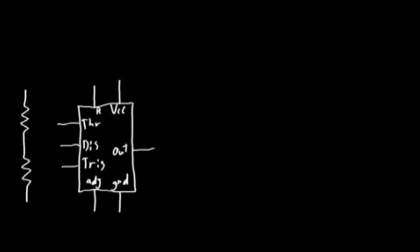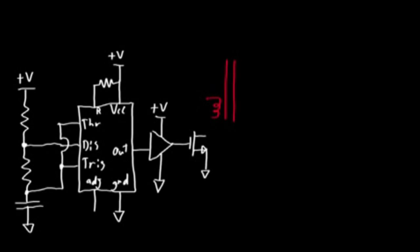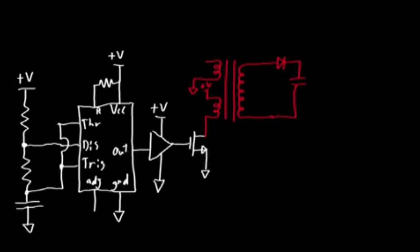What I want is something that latches off until the inductor is discharged, but also will continue to oscillate if the output is shorted. I'll call it the Joule Thief 2.0. I'll start out with a TLC 555 timer, because I can't think of a more obvious way to make something oscillate, and because I want the reset pin on it. Let's set it up in astable mode and feed its output into a transistor connected to the primary of the flyback. But instead of using a BJT, let's use a MOSFET and include a driver. I didn't realize I needed that until I had built the board — it took a pretty ugly band-aid to make the MOSFET drive work, so make sure to include a proper driver if you're going to need a MOSFET.